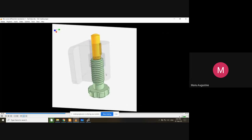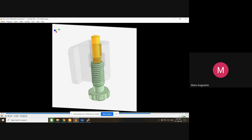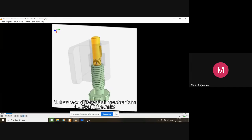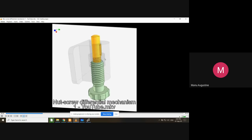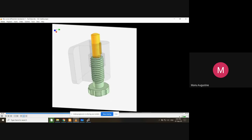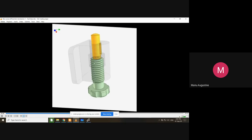When the green part is made to rotate with the help of the lever, the green part moves and the yellow part also moves in the same direction — both moving downwards together, or both moving upwards. The threaded portion of the yellow part is going inside the hollow green part, because there are internal threads inside the green part into which the yellow threads are getting matched. So the overall motion of the yellow piece is in the same direction as that of the green piece.